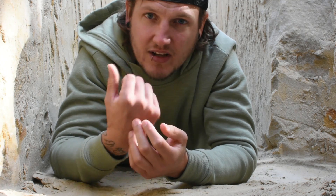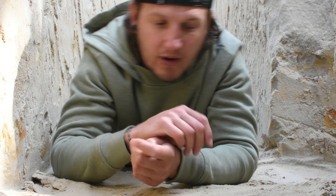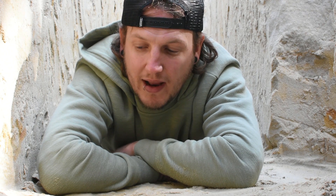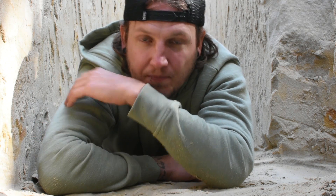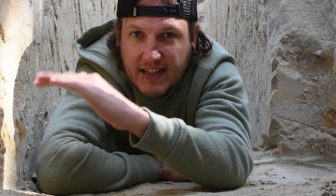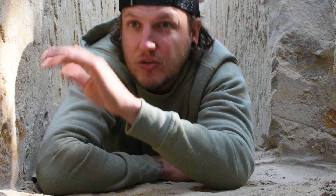What I've got to do is finish bottoming these last couple of trenches out, get looking at concrete, how much concrete is going to come into it. I know how to work out area and volume, but on this scale it's quite a lot of volume to work out — how much concrete to go in. As I said before, we need to get the datum level set. I explained what the datum level is; I'll go through it in more detail today because we're going to look at doing that.